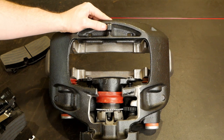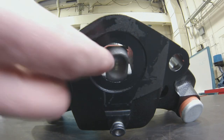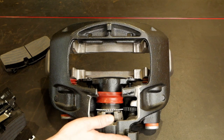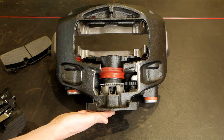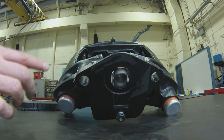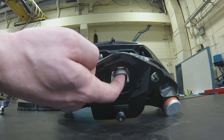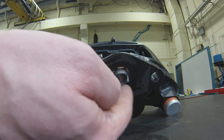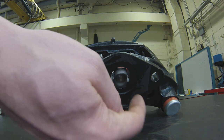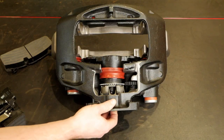As the operator applies the brakes, the spring chamber or air brake chamber makes the application right here. The brake chamber on this one would mount on this flange. Looking at that flange, there's a small cupped surface where the push rod goes in from the brake chamber. The brake chamber makes air application against the diaphragm, the push rod pushes here, and it makes the brake apply.